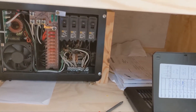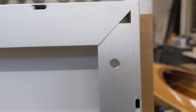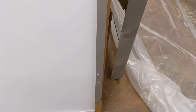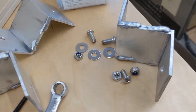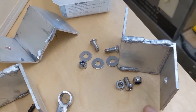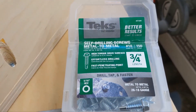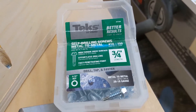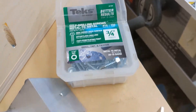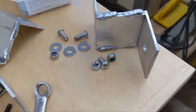There's the first bracket installed — got these all marked and drilled where they need to be, four feet down at that end, all the way along here. Putting these together with all stainless steel hardware and lock nuts — everything's gonna be locked in. To fasten these down to the deck I'm using tek screws. These are self-drilling galvanized — they work really nicely and zoom right into that aluminum. Stainless and aluminum actually don't play together as well as galvanized, so try to limit where water is gonna be sitting against it.